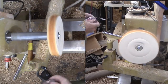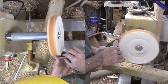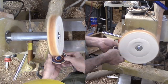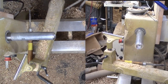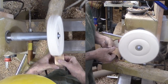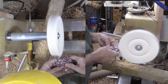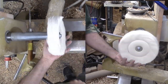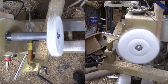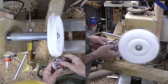Finally, to buff out the finish. I like this setup with the extender to which I can mount my buffs — Tripoli followed by white diamond and ultimately carnauba wax. Whew! Just in time for Valentine's Day. I trust my wife will enjoy it. It was a great opportunity to try the laminated frogwood with the infinite axis chuck. The base is typical cross grain. Since it is cross grain, I've kept the lid fit loose. The frogwood nicely highlights the skew features on the lid. This box is unique — it can never be replicated exactly.